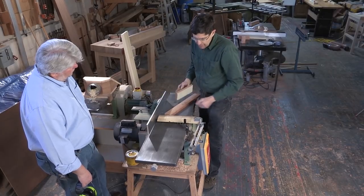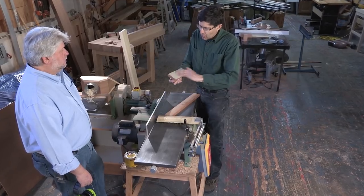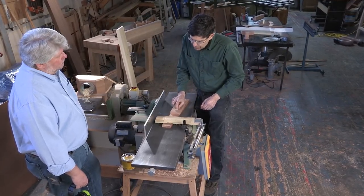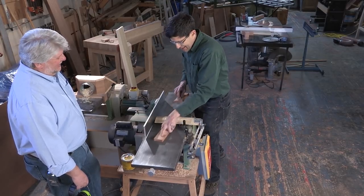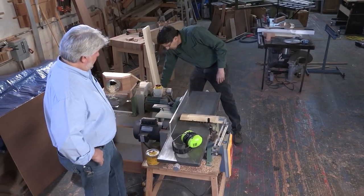When you've got the opportunity and the guard pivots out of the way, a push block like this is a great idea — something where my hand is out of the way. I put some sandpaper on the bottom and it grabs the board pretty solidly, but it doesn't work well with the European style guard. Different tools, different methods. Let me show you this with the bigger board.